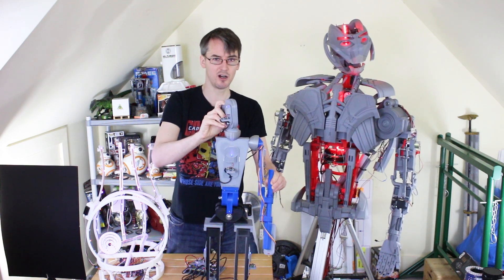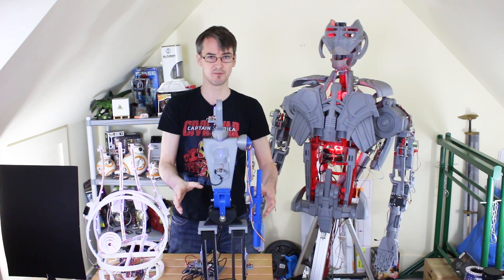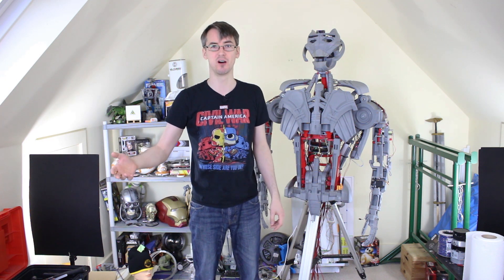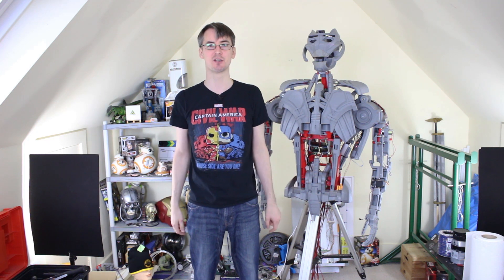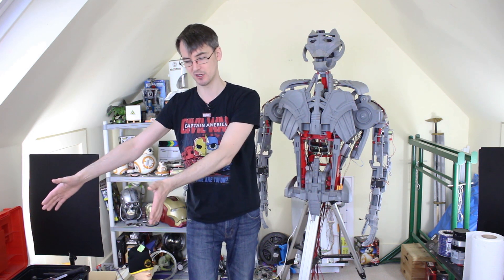Now we need to work out what to do with the other arm. As I said, it's going to be based on leg positions. A quick recap: one of the original aims was to control a prosthetic right arm from the rest of the body language. We're going to read the leg positions — if the left leg is leading, the arms mirror in one direction as if the person is reaching for something; if the right leg is leading, they mirror the other way. The left and right arm will follow each other — the right arm, which has no sensors, will follow the left arm and mirror. If the legs are in the middle, they'll mirror symmetrically. We just need logic to read those leg positions and map the axes so the right arm moves as desired.